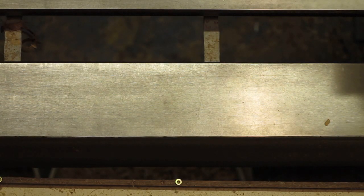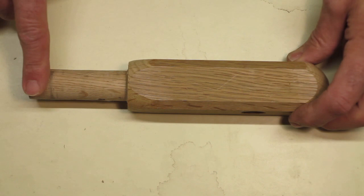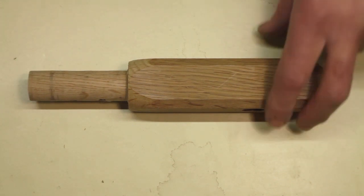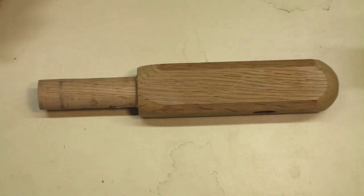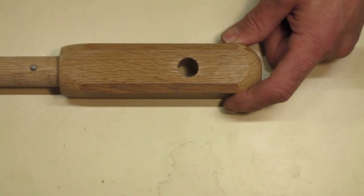And what I decided to do was to take a piece of, hang on, let's put that back up there. Take a piece of oak, and I had a piece of oak banister rail, spindle rather, that a friend of mine gave me, and I have turned this portion exactly to the diameter of the hole in my banjo, which accepts my tool rest, and obviously it goes down that far, so I can alter the height should I so wish. But this corresponds to the centre of that hole, and that is exactly at the centre of my spindle on the lathe.